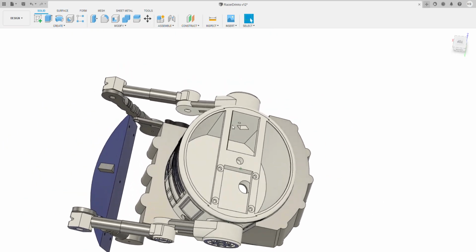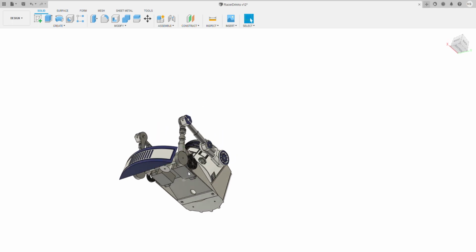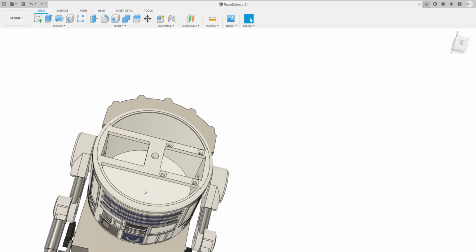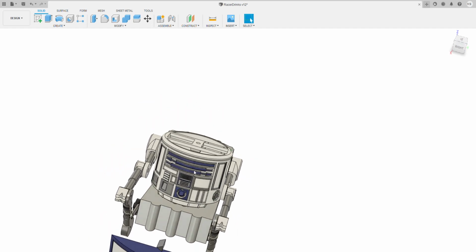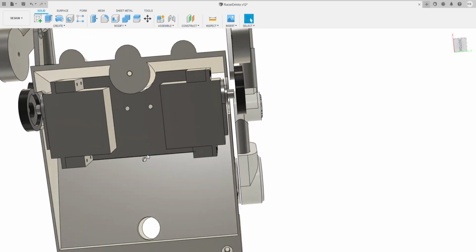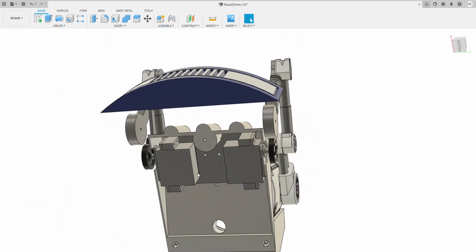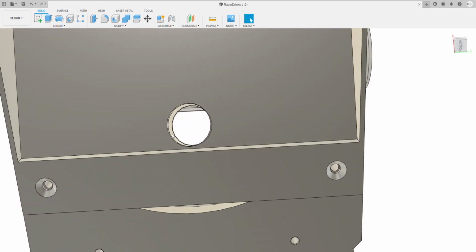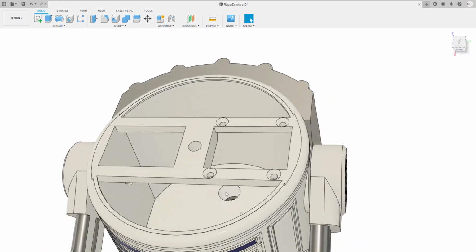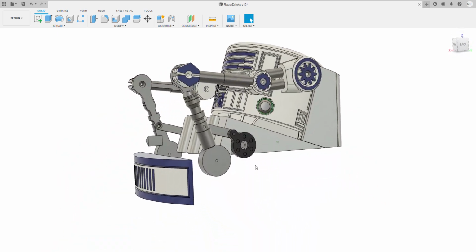brackets. The only difference is, and you can use any printed body already, you put the printed body in, you cut through the hole at the bottom, which is normally where you screw the center leg in, and that bolts in through this little hole here. It's self-tapping, so it self-taps into there, and then just get a normal drill bit and drill into the body frame, which lets you then drop that servo to control the dome into the main body cavity.